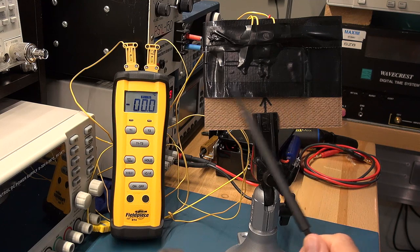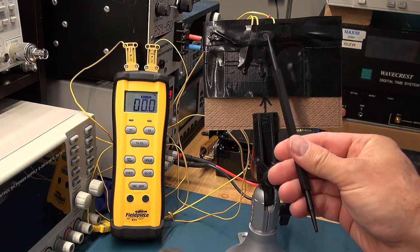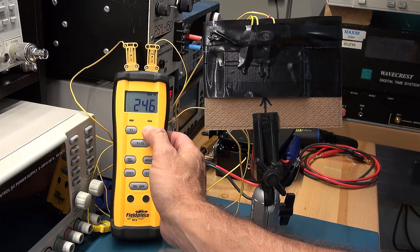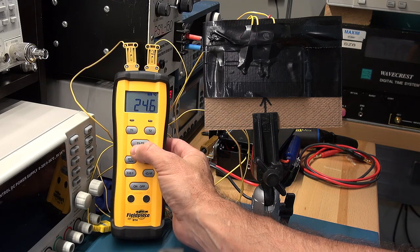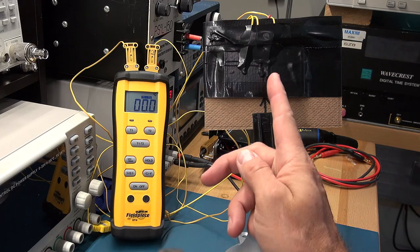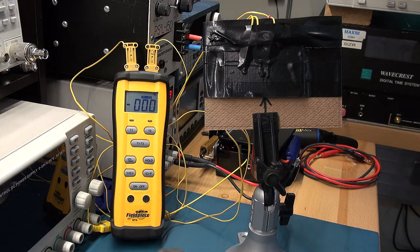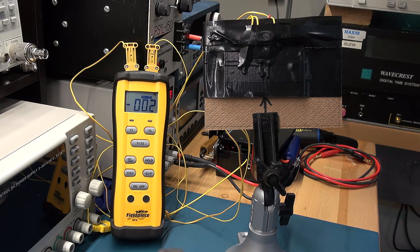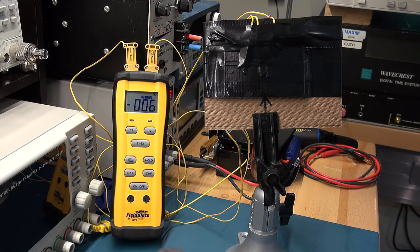The thermometer is set to show the differential between the two probes — one right at the junction between the two Peltier elements. T1 is at 24.6 degrees C. I've calibrated the probes and am confident they're within at least half a degree C. For this test we're not too worried about the actual temperature reading, just the differential. T1 minus T2 is at 0, and as I apply current we'll see the temperature differential. I'm going to switch it on — you can see it's starting to change already. I'll get another thermal camera to show you what can be seen with a higher resolution camera.